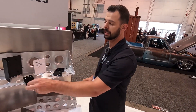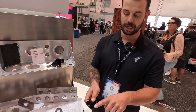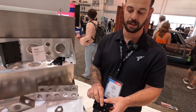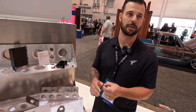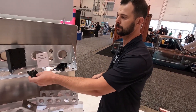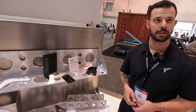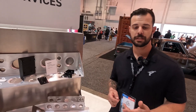We also do hardware installation — we can press in studs so you have threaded studs, flush on the back side. This one has powder coating, and we offer thread protection on powder coated parts so you don't have to chase threads as a secondary operation. Great for all sorts of brackets and clean installations.